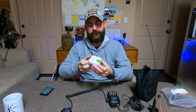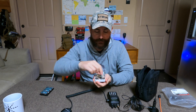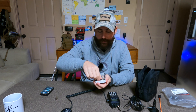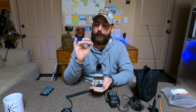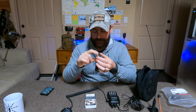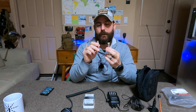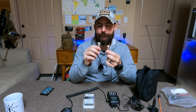The last piece of kit is just a small tin with a few connectors. I have a second SMA to BNC connector in case the first one fails. I also have a BNC to SO-239/PL-259 so I can stack these — if there's an antenna somewhere that has a PL-259 I can go ahead and connect that. For redundancy I also have another SMA to PL-259 connector. I always mix up the SO-239 and PL-259 male/female designations.